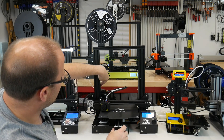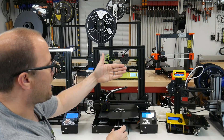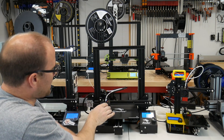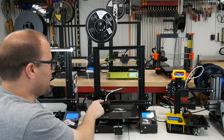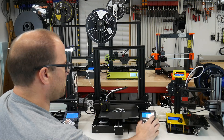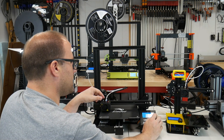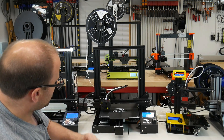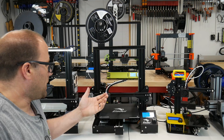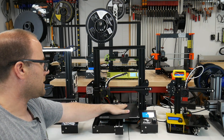The filament comes down to a motor that pushes it in and out — that's called an extruder. It's constantly pushing filament in and pulling it out at different rates to give you different amounts coming out. It falls through a tube and goes down behind all these fans to the hot end, which actually melts the plastic at a certain temperature — these use Celsius. Most general nozzles nowadays are 0.4mm and the plastic comes out when it's hot. Right now nothing is turned on. It's cool to the touch and I can touch all these parts.